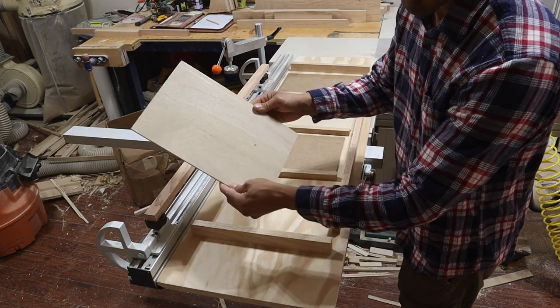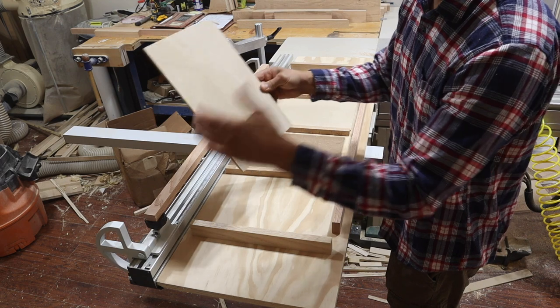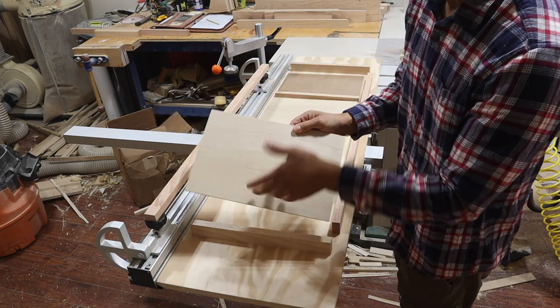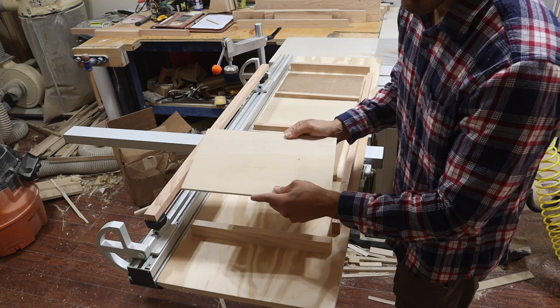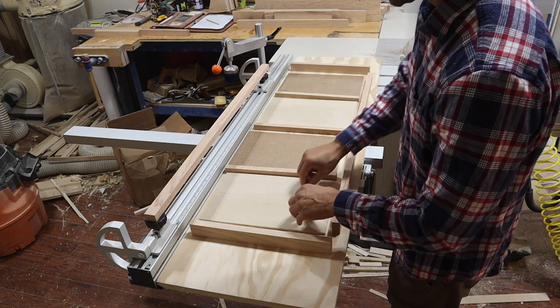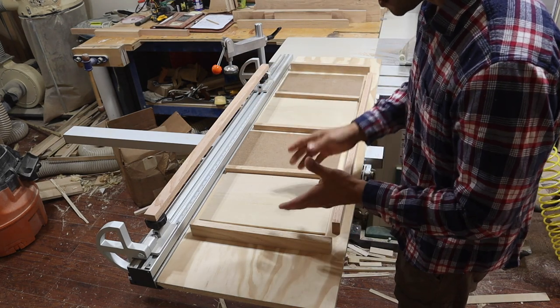And the customer told me that when they slide the comic books into the case that they have now, they're very tight and they have to force them in. So I gave them about a 1/16 of an inch gap on each side, so they won't have that problem. They'll just slide right into the display. So what we're going to do is to assemble this.